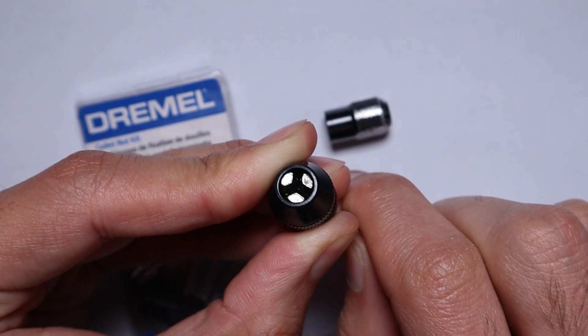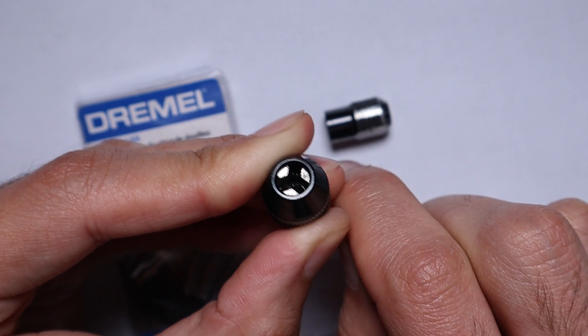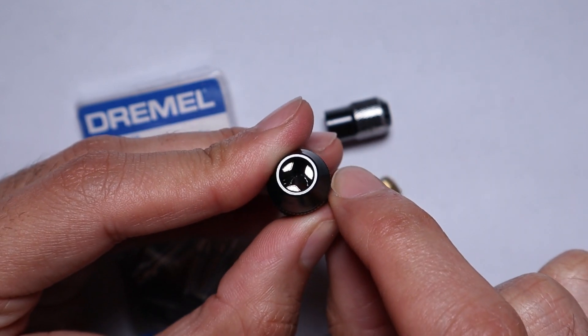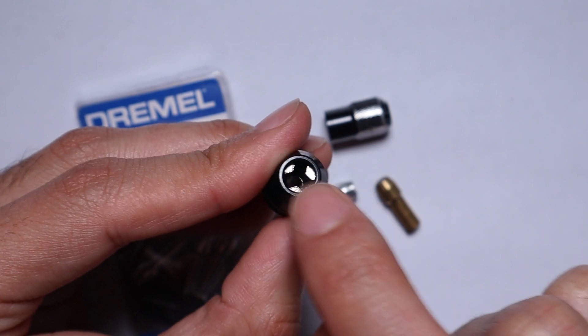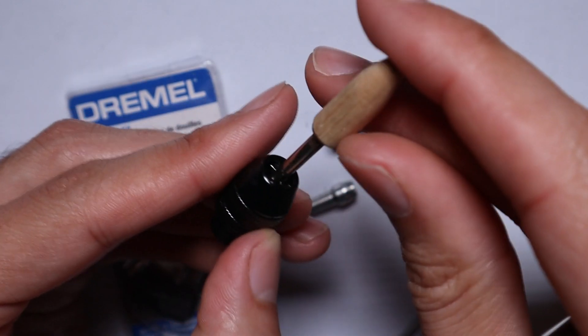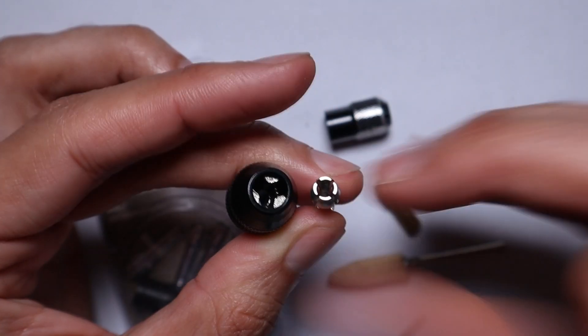With the chuck, you eliminate that completely. All you're doing is screwing in less far for one shank and further in for the other. You've got all of that play to fit whatever shank you want in there, up to its maximum fully-retracted size - well and truly enough for any kind of shank. So if you put those head to head, the adjustable chuck does win on adaptability.